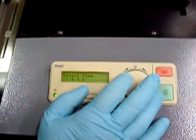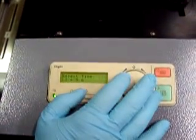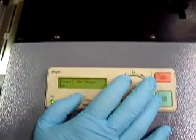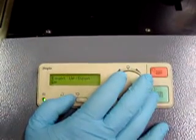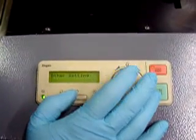On B, we usually set it a little higher because you've got a heavier cover and it needs a little more driving time to get the cover out. Count up and down, exactly what it says. Count's either going to start from 100 and go down or start from 1 and go up to 100. And then that concludes all the settings that are relevant to this.